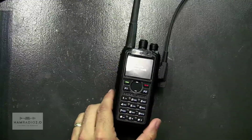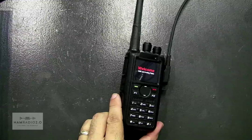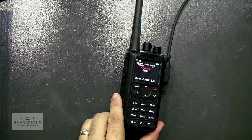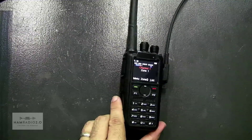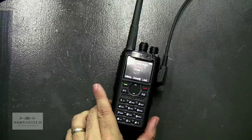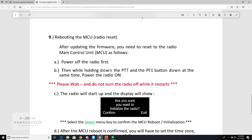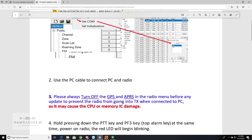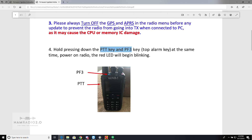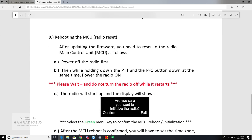The computer says write complete, and we're going to wait for this to boot up. Someone asked in a Facebook chat one time: does this welcome booting screen — is it normal? And the answer is yes, it is. Now you can see channel one is a different color than zone one. The next step, step number four: rebooting the MCU. We're going to once again power off the radio, hold down PTT and PF1. The first step is read your code plug. Second step is PTT and PF3 key — the blue button on top. Third step is to load that. Fourth step is to power on with PTT and PF1.